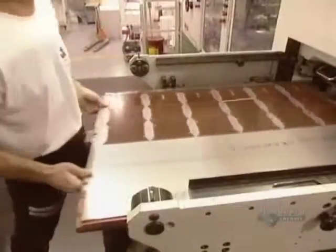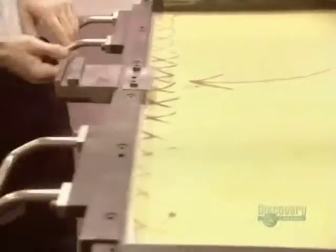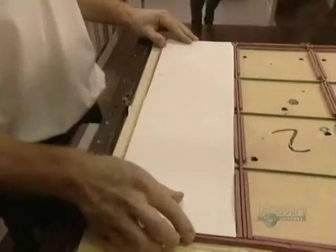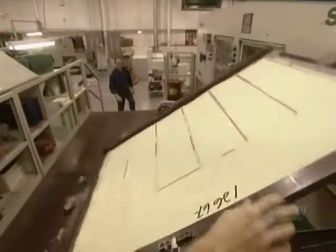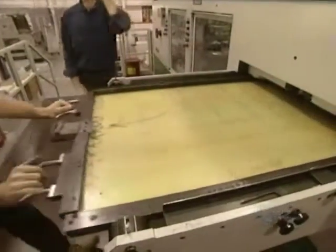The final step is the folding and gluing of the boxes. This grooved plate makes folding point marks on the carton. This machine does the cutting, embossing, and stripping of the sheets at a rate of 6,000 an hour. The cutting die cuts the carton sheets and, together with the grooved plate, makes the folding joints.